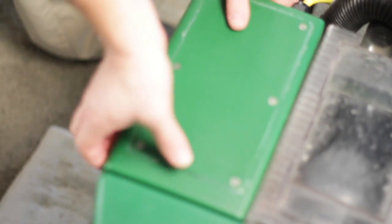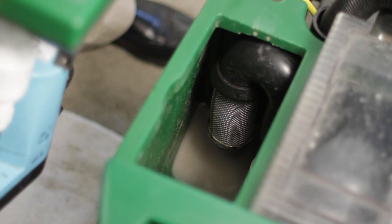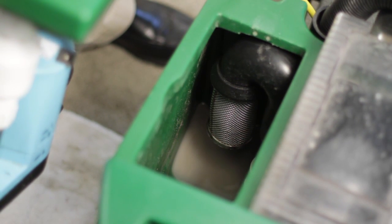If the vacuum shutoff float ball does rise prematurely, simply remove the waste pump lid and dislodge the float ball from the cage.